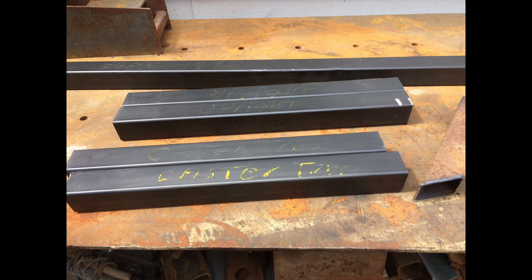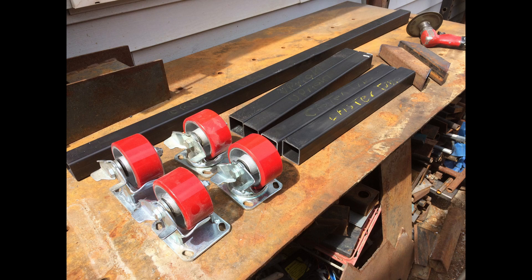These are still pictures of the parts ready to be welded together. They've been cut to length — everything we'll use to assemble the base. These are four-inch casters; the total overall height with the bases is five and a half inches, so we add that into the height of our brake. These are all locking wheel casters. You can put whatever you want for casters underneath them; I just happen to have these in stock.